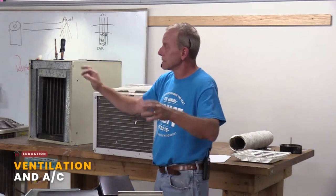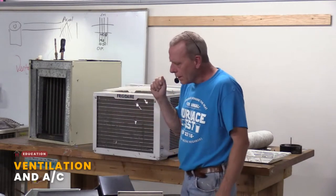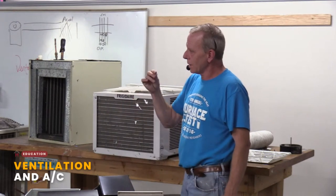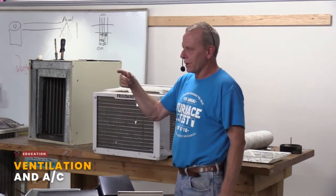And a lot of times, I'll say this as the last thing because we are about done. With a lot of the new air conditioning units, they're designed to run longer. This is something homeowners have to get used to. They may be used to an oversized unit that would run for 15 minutes and cool the whole house down and shut off. Some of the newer units are designed to use less energy, and they run for a longer period of time because they're working on getting the moisture, the humidity, out of the air.